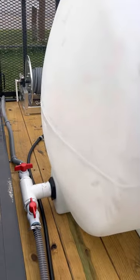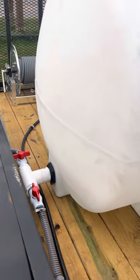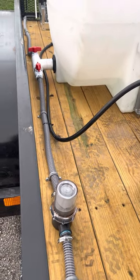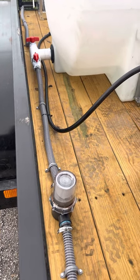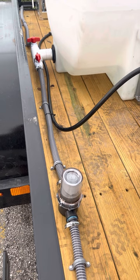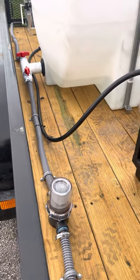In this case we have just a machine only, so this is going to be very basic. Water coming out of the tank comes up here to a clear bowl filter. We like the clear bowl filter because it occasionally reminds somebody that there is a filter in there. The debris builds up on the inside of this filter — just because the outside looks clean, it may not be clean on the inside.